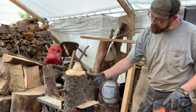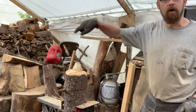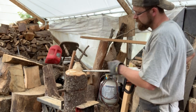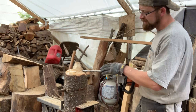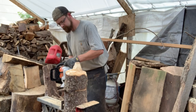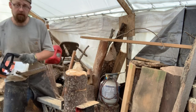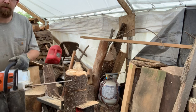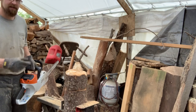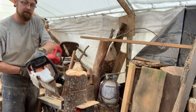It's time to figure out the height of your pumpkin. I'm gonna come down about four, four and a half inches. I'm gonna do a line all the way around — go in about an inch and a half, maybe two inches, depending on the girth of log you're using — and make that line all the way around, try to make it straight. There are times I'm walking around doing this, but don't do that — it's not safe. Get your body planted, feet firm and square on the ground. Your lines get way better that way. Now we need to round the bottom — angle it into the bottom and cut down to your line.